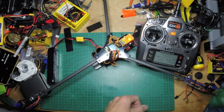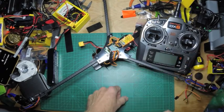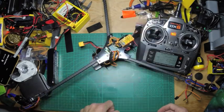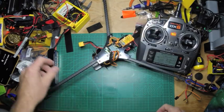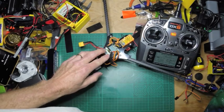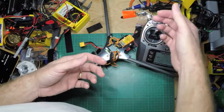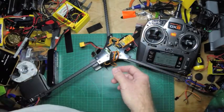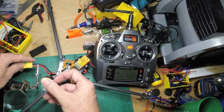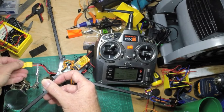My next thing I'm going to try is to calibrate the ESCs and see if that makes a difference. I'll turn on the transmitter and put the throttle all the way up. Then when I plug it in, I have a few seconds to press buttons one and four together, and then it'll beep, and then I'll throw the throttle down and it'll beep beep beep. I'm going to use two pins to hold the buttons down and a soldering helper to connect the battery.